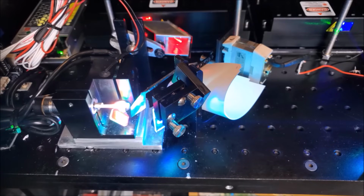Let's discuss another safety mandate. Here in the US, a lot of laser products are required to have a mechanical shutter, which will terminate the beam and prevent it from leaving the actual product in case of a malfunction, if the interlocks are no longer properly engaged, or if the emergency button has been pressed. And show lasers are no different, especially with this kind of wattage.